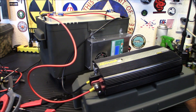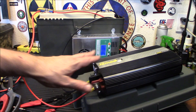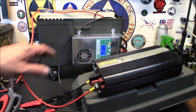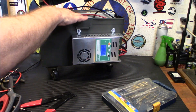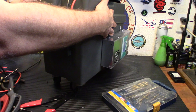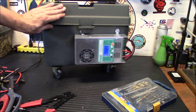And there's the finished project. All that's required now is to tuck the cables in, put the inverter on top, and close it up. The charge control is lit up and the inverter is ready to go. It had a little discharge when I connected the red wire — this packs quite a punch after you unhook it, so you want to turn it on and let it completely run out first. I'll just run the wires underneath — it should work just fine.